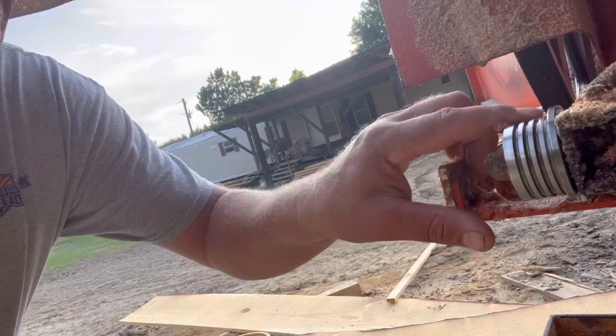we had a blade. I don't know if I showed you that. Right here on this roller, we had a little buildup on that roller. What happened is he wasn't putting enough diesel on there. He had turned the diesel down for too long and it built up on there. What that did when you got that buildup on there, that blade dove. As soon as it dove, you know, we had to see what's wrong. Either the blade is dull, out of set. I mean, there's several things that cause that, but as soon as I seen that on that blade, I knew what it was. It's a little bit of diesel. Clean that right back off.